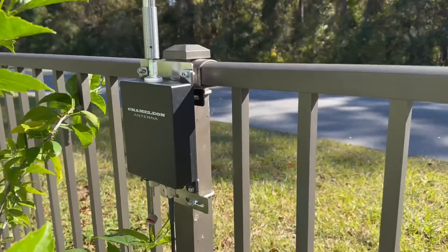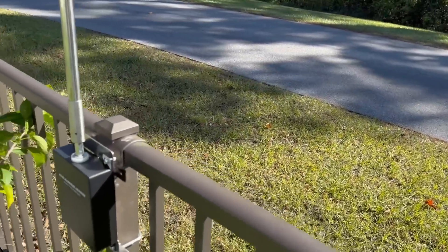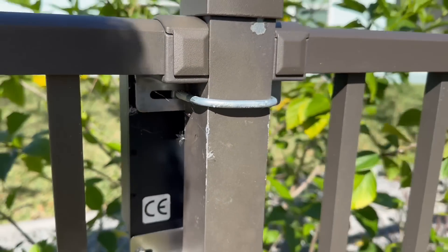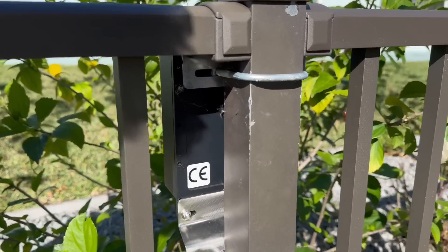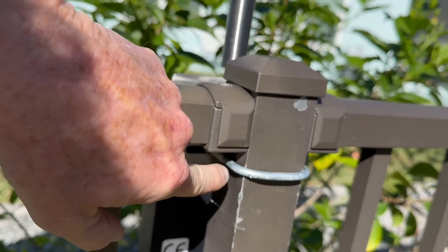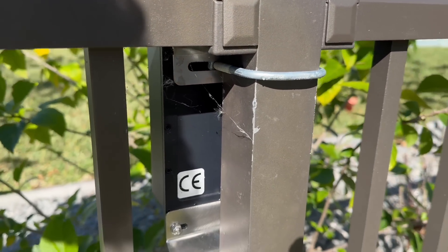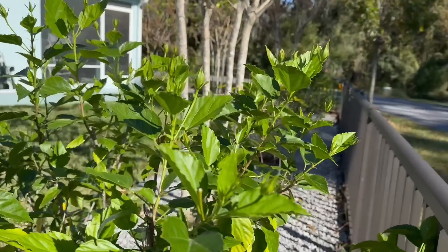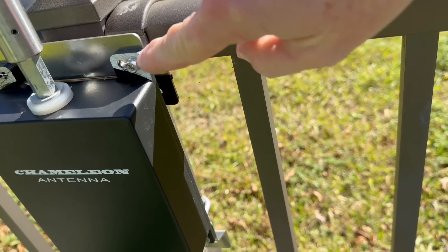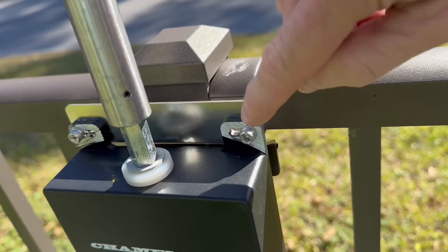What I've done is I've strapped it to this aluminum fence that's used as a counterpoise. As you can see, it's strapped to the fence on the back side there. These attempt to make contact with this fence — you can see where I've scraped it a little bit to help make the contact. And since this is anodized, and anodized is not electrically conductive, I filed a couple of the areas here on the ears so that there's electrical contact.